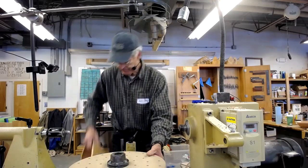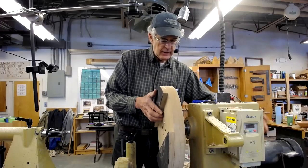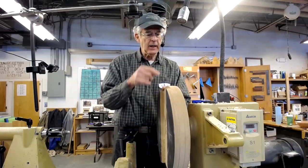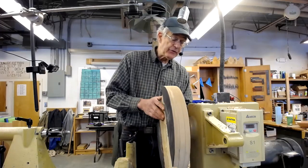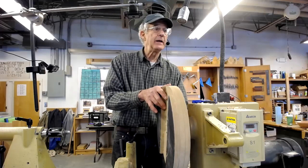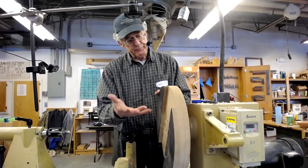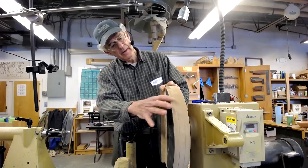And so this is again something Glenn Lucas developed. This is made up of just, you can use plywood or MDF or whatever. And I probably overbuilt it as usual. Just use a piece of 3/4 or bigger MDF. I did 2, which was silly, but I only had a small faceplate. Ideally, you would use the largest faceplate you can get, or that you have, like a 6-inch one would be great. That really spreads out the area that offers stability. And then you have 2 sections like this